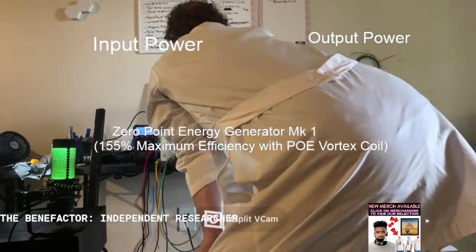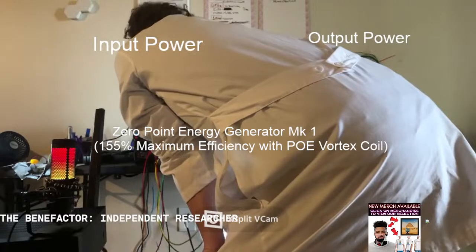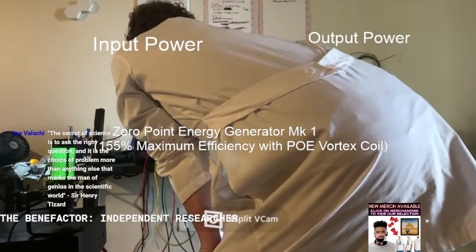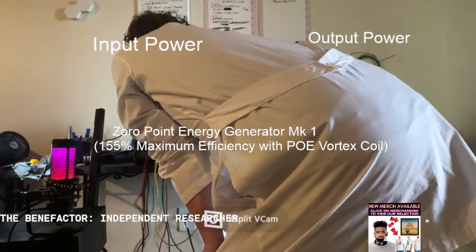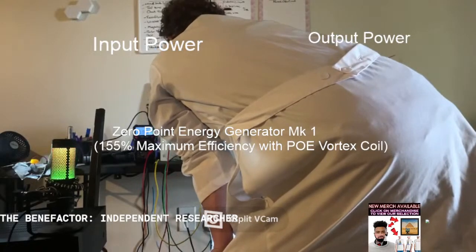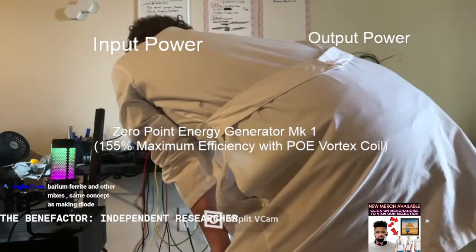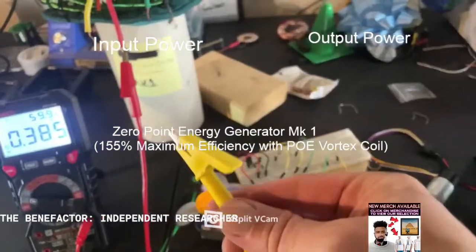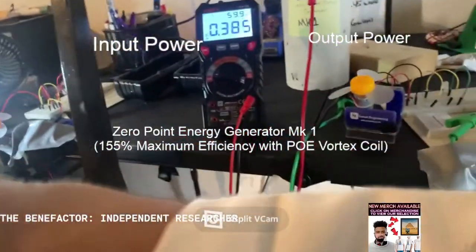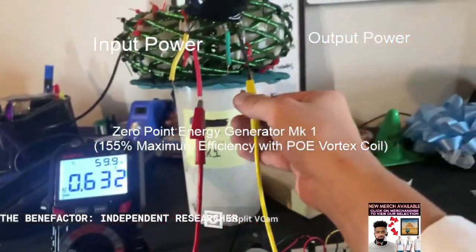Alright. As you'll see, the start of channel A is hooked up to the positive of the tone generator. So the positive, the red wire here, again, I have everything color coordinated for your convenience. That is hooked up to the start of channel A, so basically the same way we would hook it up normally. Now here's where things get interesting. The finish of channel A is hooked up to the positive of the load. And the positive of the load, as you know if you followed my guide, is the yellow right here. Here, let me zoom in for you. This will be better. Okay. So, this is the positive of the load. This is going to be hooked up to the finish of channel A, like so.